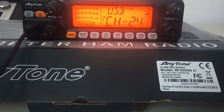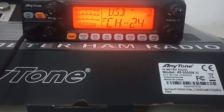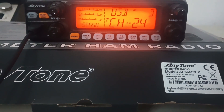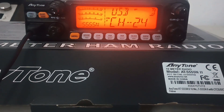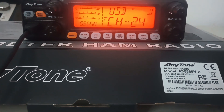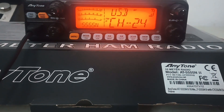We are going to test it at 14.8 volts. The reason we're testing at 14.8 volts is that's the maximum I recommend someone to really run these at — 14.8 to 15 volts. So if anything crazy is going to show up due to running at higher voltage, I want it to show up here. That's not to milk it for power or anything like that.